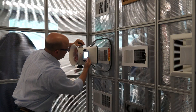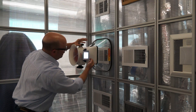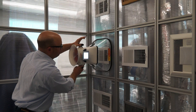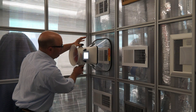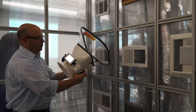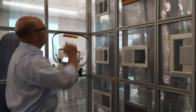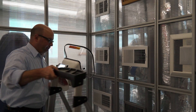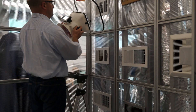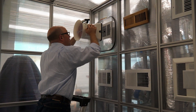On the bottom it begins to show which direction the airflow is, indicated by an arrow, and it ramps up to balance out the pressure. We read 189 CFM for the kitchen. I'm going to move up and do bedroom number three.